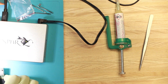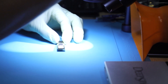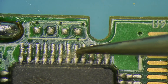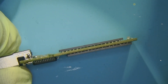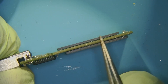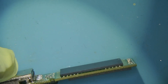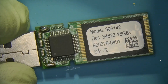I'm going to turn off the device for now — we'll come back in a little bit. Now it's safe to inspect and let's see what kind of work would be involved. I noticed that the pins on the controller are very loose, and that's a really good indication that's where the problem is. It's not necessarily the only problem — these are BGA chips, and if this board got flexed hard enough, the solder balls that hold the chips in place could be dislodged, or the connection between the chip and the board could be compromised.